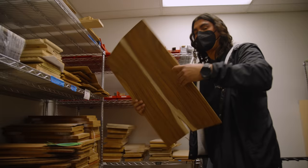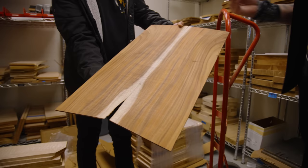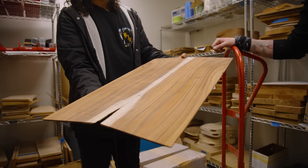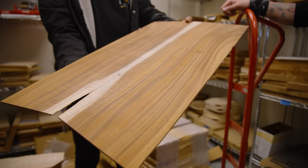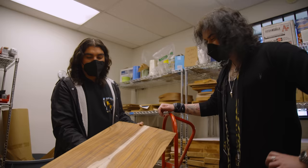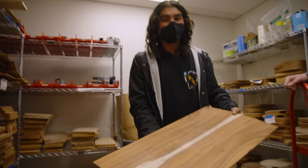This is koa — this would be one top for one guitar. Koa is such a unique wood. You can only harvest koa after the tree has fallen over, so koa stock is always kind of in and out depending on when there are storms in Hawaii — that's when you get to harvest it. It's a very special, very unique sounding wood. It has such a snap, a nice airy quality — it's one of my favorite tones. When you play enough guitars you do get used to the subtle differences, and something like this would make an absolutely exquisite looking guitar.